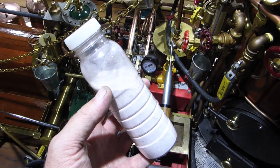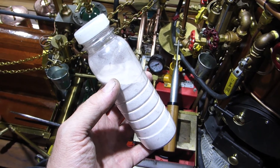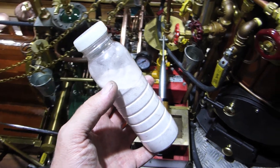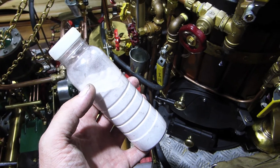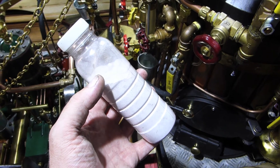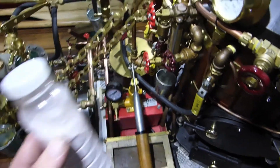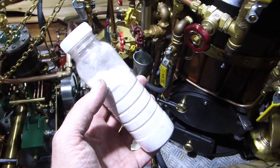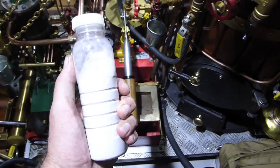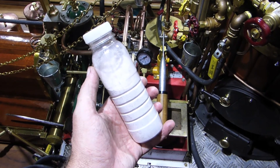The last ingredient is soda — sodium carbonate — which acts like a wash solution. Inside the boiler the pH is quite high, so it is alkaline, which prevents rust formation and bacterial growth, and also dilutes residual oil coming from the machine going to the oiler. Everything is diluted in this mix, and finally when you empty the boiler everything is blown out — it is certainly not hazardous for the environment. The recipe varies a bit and I will show my recipe in this video as a list.